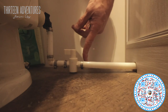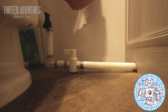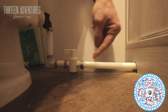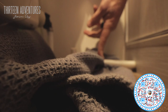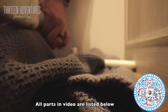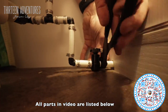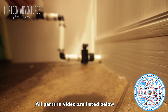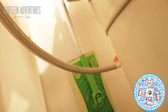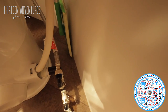You can see the existing water line comes out of the cabinet here. Here's your shutoff valve — it turns up and goes into the back of the toilet. There's a flexible line right here that feeds the toilet itself, but the water's off. I've got to cut this line so it's going to leak somewhat, so I'll grab a towel. I'll cut this in a way where if I need to in the future, I can just reattach it with a straight line fitting. There's a half-inch fitting on this end and a three-eighths fitting on the other end. The original line that came with it was three-eighths on both ends. Tighten on the three-eighths inch here, line goes back behind, and it goes down, coming in the back of the toilet.